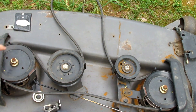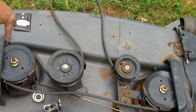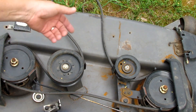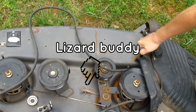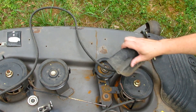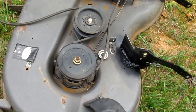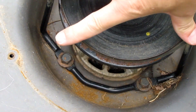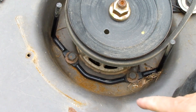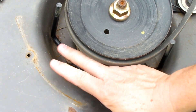What we have to do is take these two plastic guard covers off, and then these guide pins that hold the belt onto the spindle pulleys — they're bent together and have a couple of bolts each holding them down to the deck. We've got to take those off so we can get the belt out from around the spindle pulley. These two guide pins are what hold the belt onto the pulley. They've got to come off — you've got two bolts here. These are half-inch; you need a standard socket, as the deep well is too tall to get in there.